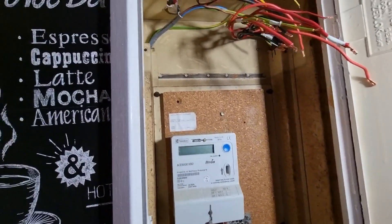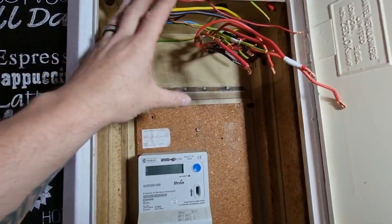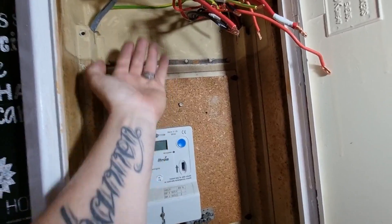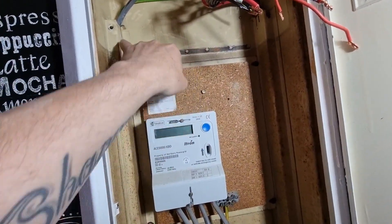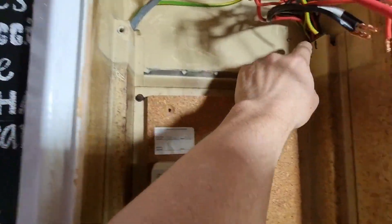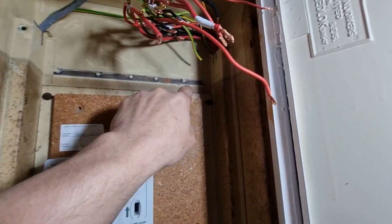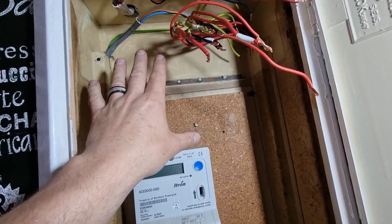Here we are — I thought I'd share how far we've got so far. What we've managed to do is strip out all of the old board. We've taken out this shelf — it was right in the way, it stopped people putting their hands up inside the board, but we've ripped that out because we don't need it there. Then I've had to cut these back because the fuse board was just too big to slide in there, so I've cut these back so it's roughly the same distance off the wall, and I've just tried the board in there to make sure it fits.